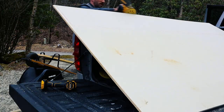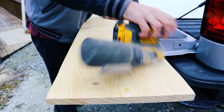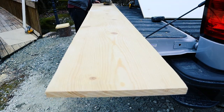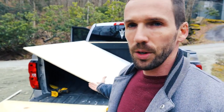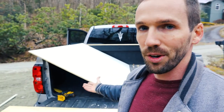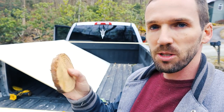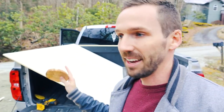Sand everything down — I'm using 80 grit sandpaper first and then going back over with 150 grit. Much of this doesn't need to be super smooth. The bench I would like to be really smooth because it'll need to get dusted and wiped down. It's starting to drizzle so I'm going inside — you don't need to watch somebody sand over and over. I will be sanding these logs tomorrow, then finish painting this, and hopefully finishing as well.